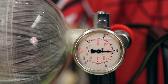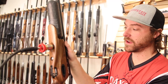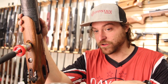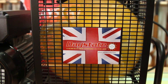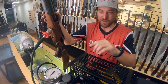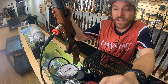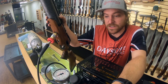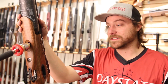The compressor can be used to fill tanks, or with the right adapters, you can fill the guns themselves. Here we have a DIN-to-QC adapter connected to a Red Wolf right here — it's right at 200 bar. I'd recommend staying with your gun because it fills a lot quicker and you want to bleed it every couple of minutes to avoid any moisture. Keep in mind the auto shutoff is at 4,500 — I only want to go to 250 bar, so I'll stay close and watch it. This shows that you can use the compressor connected directly to a gun to fill it in just a couple of minutes.